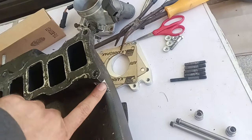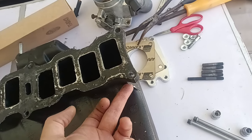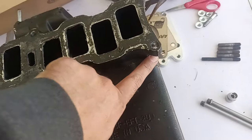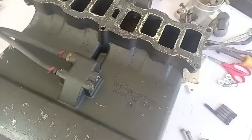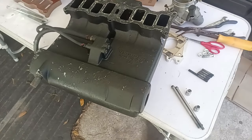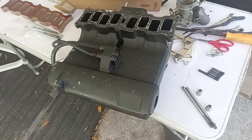There are also a couple of things that have been recommended — there's casting flash here with sharp corners where the bolt goes, and getting a wrench in there can be a pain. They recommend getting a file or a dremel and rounding those corners off. It also helps with it not cracking — not that it's a stressed unit or anything, but just food for thought.